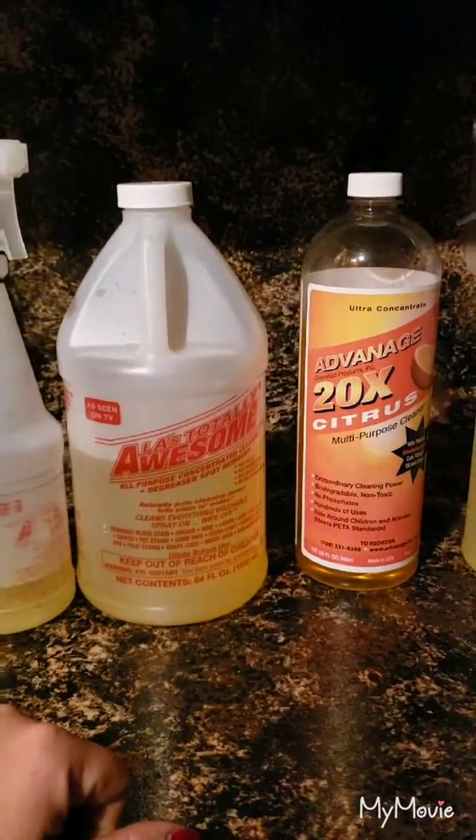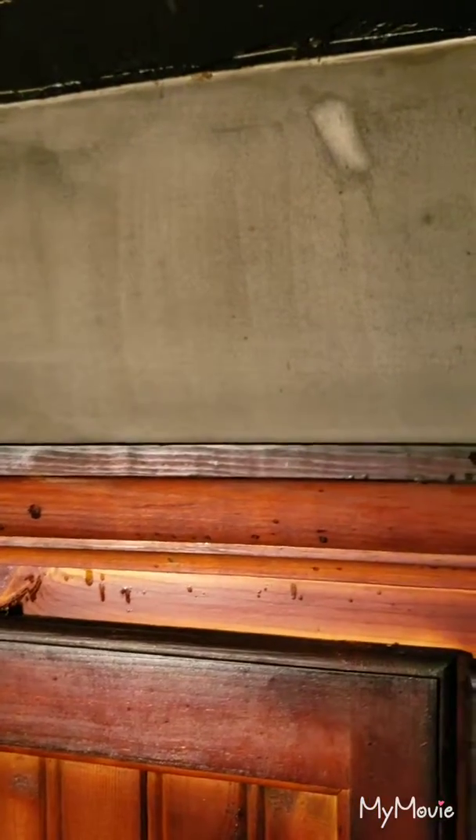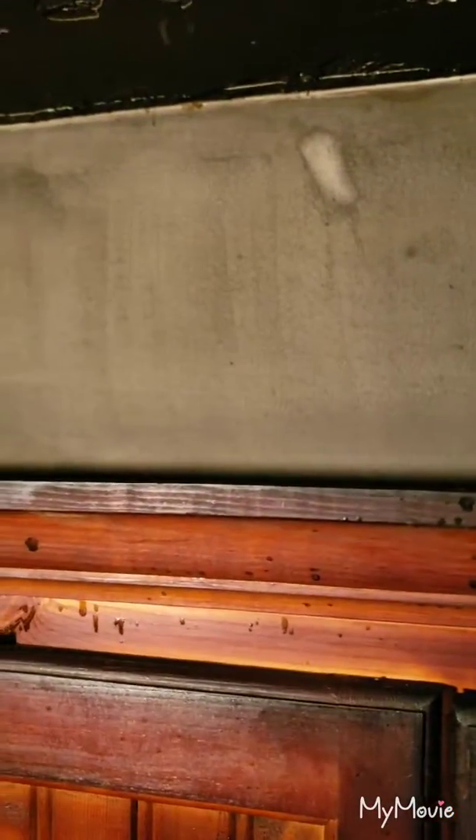As you can see in this corner, it's untouched compared to the area we're going to work with. I've taken a chemical sponge and done downward strokes from top to bottom. It is very, very important that your first touch on these walls is with a chemical sponge — a dry sponge. Your first touch should not be with any type of wet solution, water, or cleaner. So you can see how bad the walls are to begin with versus what you'll actually be working with after the dry sponge pass.